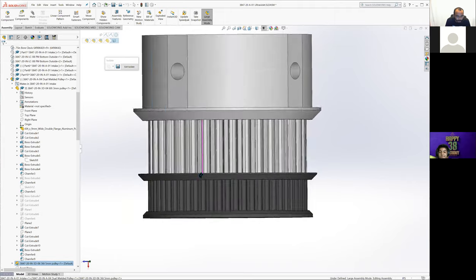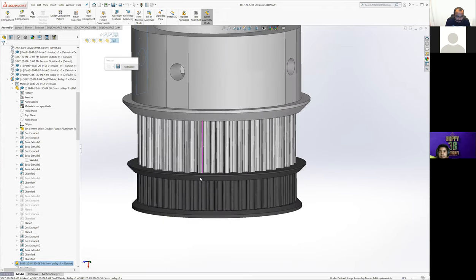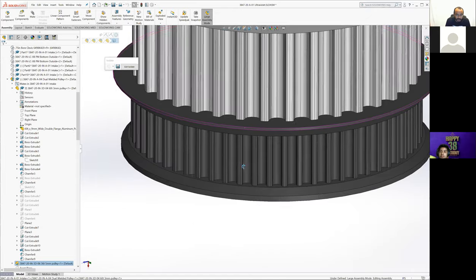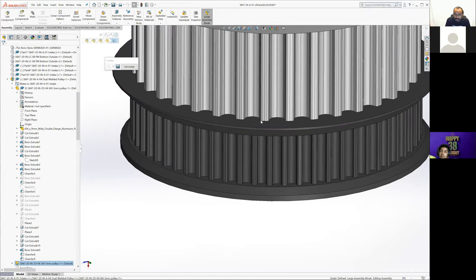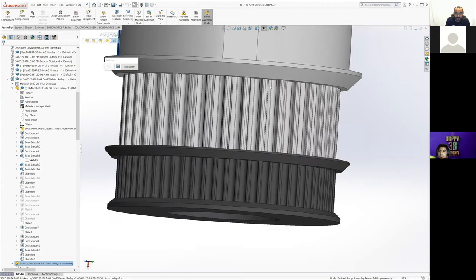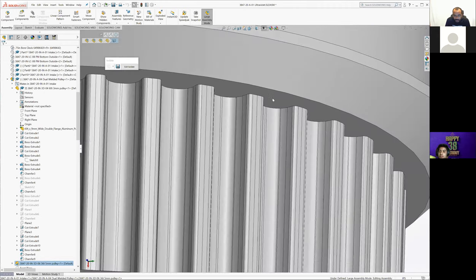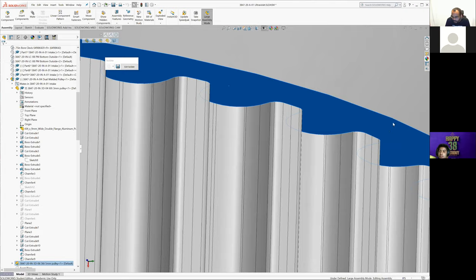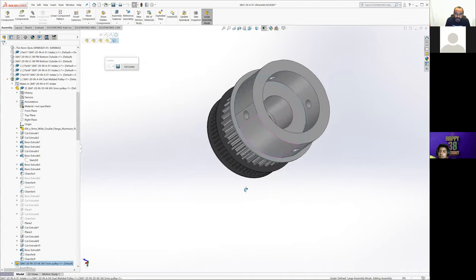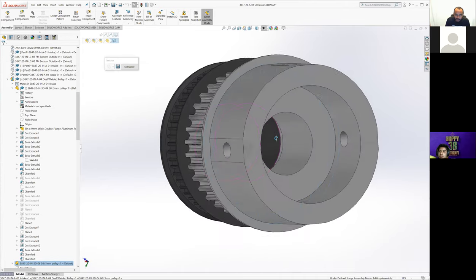Yeah, so then the pulley would have been printed like this on our printer. So that's why these walls are sloped. And then you can put a flat here since this is going to be fully supported by the one underneath it. Then you print up again and you have some overhang. So you will get some kind of overhang and some drips and some droopiness in the filament here, depending on where the walls are, especially this overhang out here. But largely it doesn't affect the way the pulley runs. So it works pretty well.